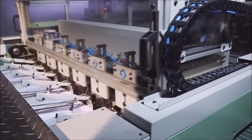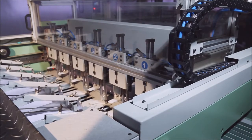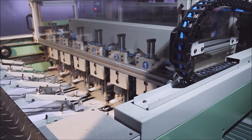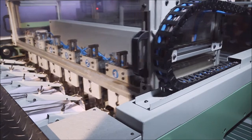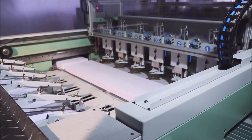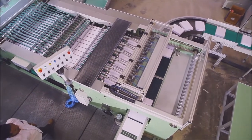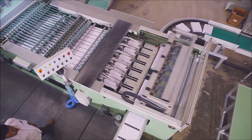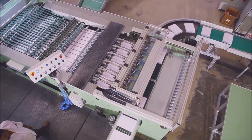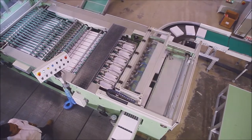The cut-size sheeter is equipped with a heavy-duty robot mechanical unit to collect the ream of 500 sheets into the collecting box at every point of completion of 500 sheets in each pocket. The robot unit will automatically come forward, pick up all 6 reams from each pocket at a time, go back and place them on a conveyor belt to transfer to the automatic ream wrapping machine.